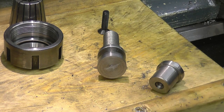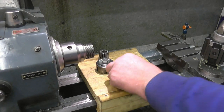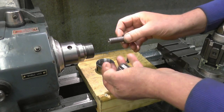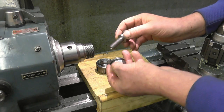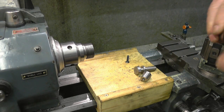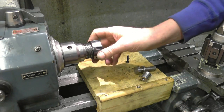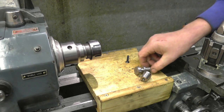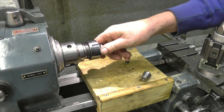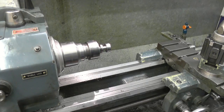Indexing is going to be the fun part of the whole job I think. I'm going to grip this into the collet because it grips over a long area and the collet won't damage the threads where a 3-jaw chuck would. It's running nice and true — that's one thing about the collet: you can take it out and put it back in and you can guarantee it's running within half a thou.